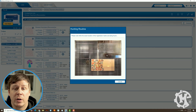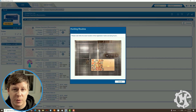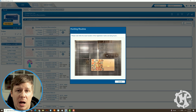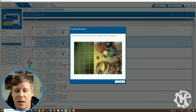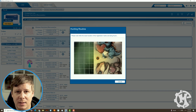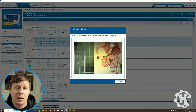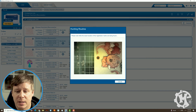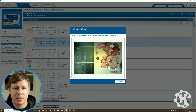You need to make sure your cameras are in focus to the material, or rather you need to make sure your material is in focus so that the camera recognizes it properly. Once I hit confirm to print, what you'll see is the hunting routine. What this means is that the gantry is going to move toward where I had those pick points, and the registration dot camera to the right of the head will actually zoom into each of those dots. It will try to recognize that dot and then capture it to translate back into the software. It communicates back and forth to make sure that all of those cutting lines will be in the correct position when the job actually machines. Once it is done, it doesn't really tell you that it's done — it just disappears. So the window will just go away and you will have to just go to the machine and the job should be there.